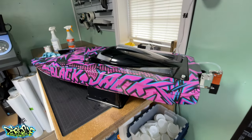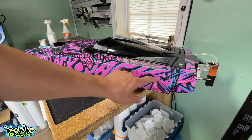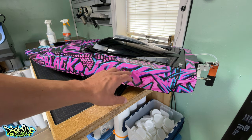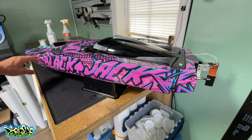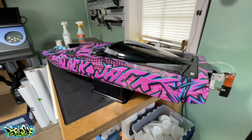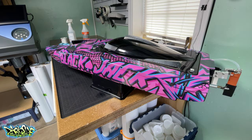I am going to speed the film up and do the other side. It'll be the same process. You can watch me try that other method. I think I'm going to try on the other side with this strip. Cut along the edge. Have the knife follow the cut edge. And then come back and do a final 16th inch gap, okay? So let's get the camera set and off we go.